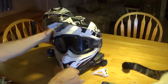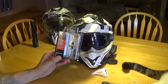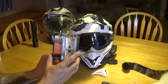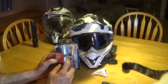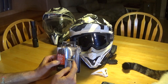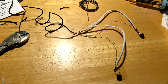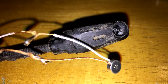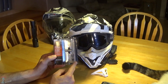If you want that setup, you've got to buy — there are probably other ones — but this is the one I bought. It's a Sony ECM-SC3, about $20, bought it on B&H Photo. You've got to take it apart, so you're basically destroying it, but it's only $20 so it's not a huge deal breaker. You take it apart and there'll be two little microphones in there and three wires: a ground wire, a left, and a right. The ground wire is a pain because it's braided and wrapped around the other two wires. Separating this out is kind of annoying, but with a little patience and a soldering iron, it's not a big deal. I have some pictures I'll throw in the video.